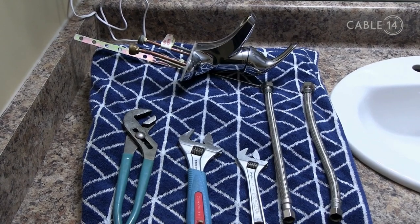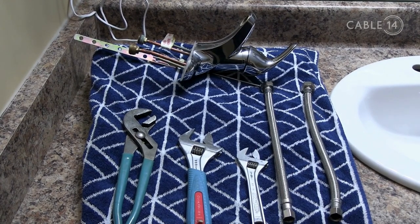Let's take a moment to go through some of the tools that will be required. Obviously your faucet — Bob's top pick, the Moen. To the left, you're going to need some water pump pliers. To the right, two different sized adjustable wrenches, large and small. The final item is the flexible supply line hoses. These do not come with faucets. When you're out shopping, make sure to read the package to know if water supply lines are included. If not, always buy the top pick: steel metal braided supply lines.